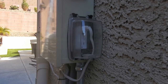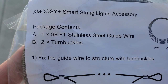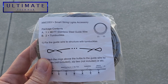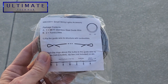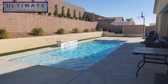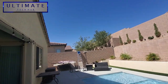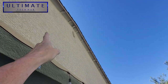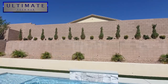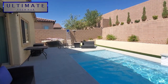One more thing — this light kit comes with 98 feet of stainless steel guide wire, and for our install we didn't need it. However, if you're going to string these lights over a long span with no support in between the lights, then this guide wire is a must. For instance, if I was going to install these lights from the back of my house all the way back to the retaining wall, I would have to use the guide wire, because the guide wire would support all the lights.